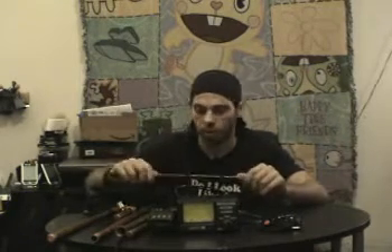By now you should understand that the J-Pole is an omnidirectional, half-wave antenna that's relatively easy to construct depending on your materials. I chose copper pipe because the thicker the material, the more power output it can handle — something like this can handle close to 100 watts. If you use something thin like 16 gauge wire, I wouldn't go over about 10 watts. For use on FRS radios, 20 or 22 gauge copper wire is fine since FRS radios won't go over half a watt of output.